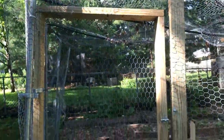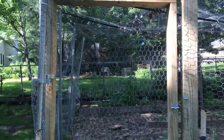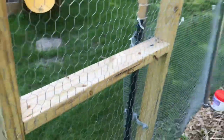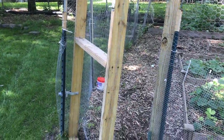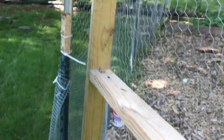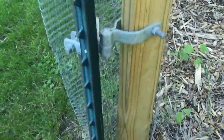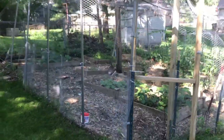The reason I didn't just use a regular chain link fence gate is it's not tall enough — you'd be ducking in and out. I wanted a more full-length door. Then I covered it with chicken wire just like the rest of the enclosure. Now we have ourselves a gate and door for going in and out of the garden enclosure. So: cut your two-by-fours to length, screw them together, and use that chain link fence gate hardware as a hinge so your door opens and closes.